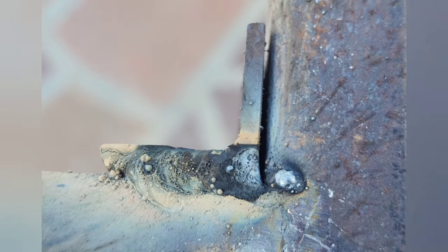This is how I made the cut — five inches, then I decided five inches was too much so I went for four inches. Underneath, the cement is very, very hard and I cut that with the diamond disc. Now I'm going to make the chimney. You can buy a chimney but I had this extra material, so I bent it forcefully, welded it a little bit, and then hammered it out inside some wood. It's easy to make — took me a couple of minutes, not that hard. I cut it at an inclining angle, and you can see it's pretty round — it's homemade so that's fine. I weld it on the top.